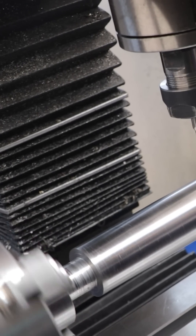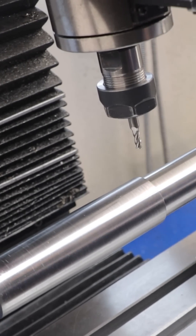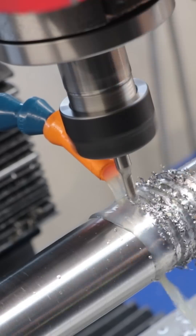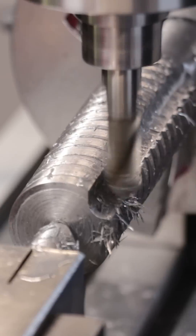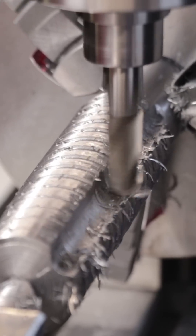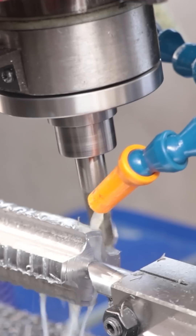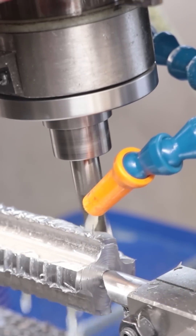Over at the milling machine I'll use the helical milling setup to cut the square teeth. You can do it on a lathe but the process is a lot more difficult. Once the threads are cut I'll then use a ball end mill to cut the flutes for the chips to go, and in doing so this also forms the cutting edge.